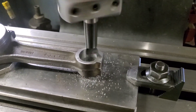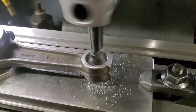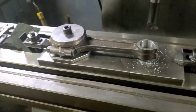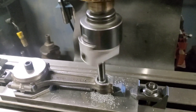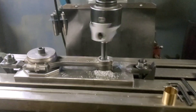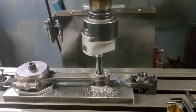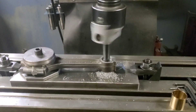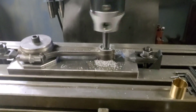We're going to take a heavier cut this time. We're boring it out — some of you guys may not have seen this before — using a boring head, that's what I'm referring to. This is pretty precise. I've got my center-to-center all dialed in. So when I put this bushing in, I'm going to put it in so the center is right. We're doing this before we recondition all the rods, so when we recon them, they'll all be the same.